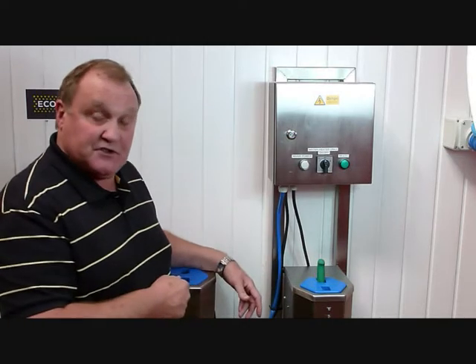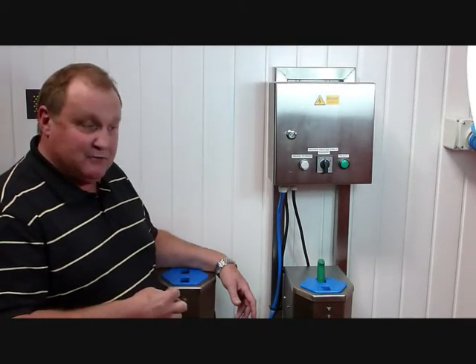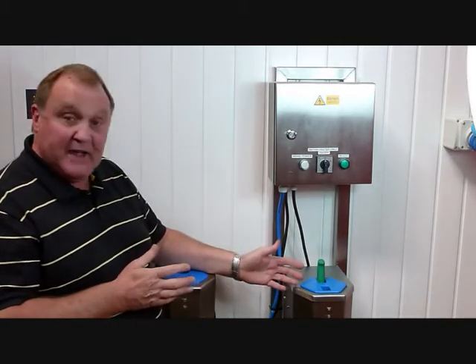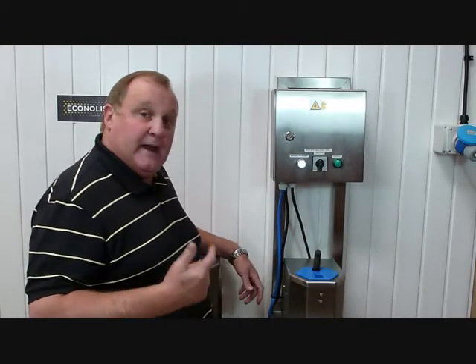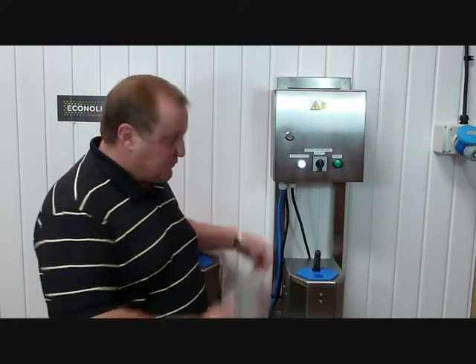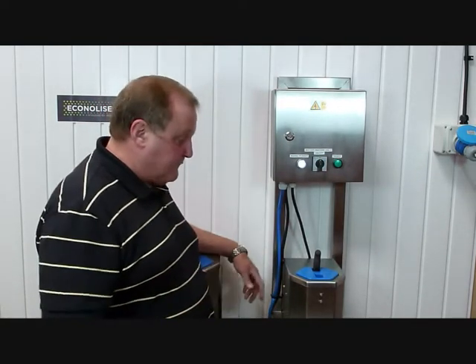The electric version also uses considerably less energy to heat the water, reducing running costs. Remember it uses around 120 millilitres each time you sterilize — if you're not sterilizing, you don't use any water. So throughout the day you're only heating the water you actually use, no more, no less. From tests in an abattoir where they killed 350 animals in a day, supplied with 8-degree water, running for 8 hours, it used just 3.9 kilowatt hours of electricity to heat the water to 90 to 92 degrees.